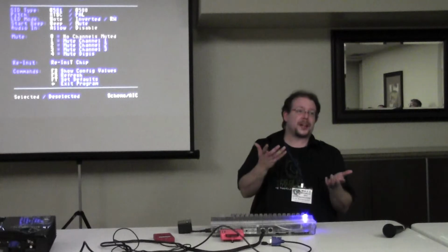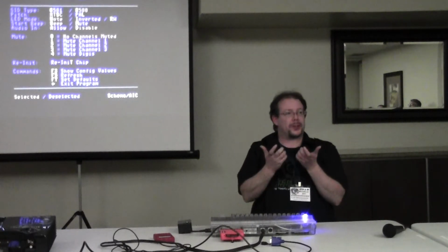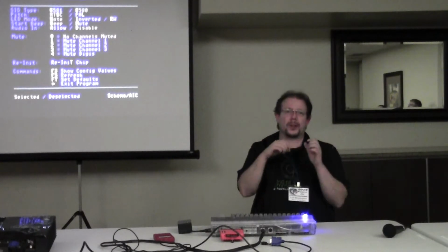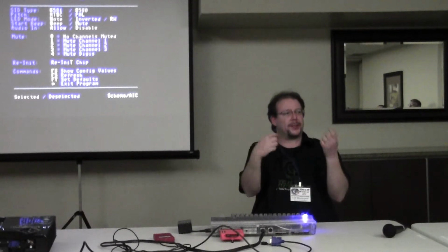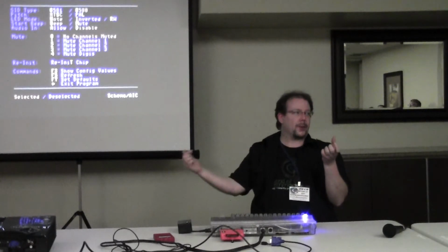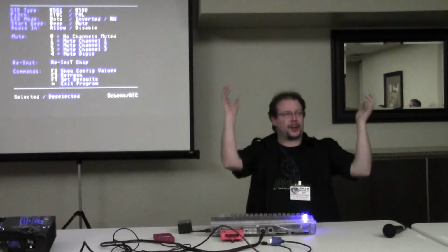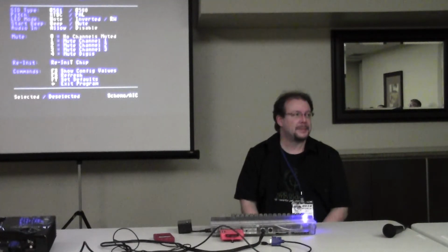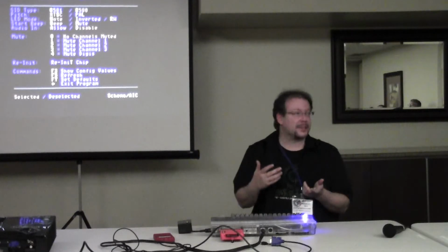Yeah, so this is actually an issue with these stereo SID boards that are coming out. You have two SIDs, especially because a lot of them have a mode where you can set both the left and right SID to the same memory address. But of course, then when you try and read the pot line, it just goes crazy because it's only connected to one or the other in real life.